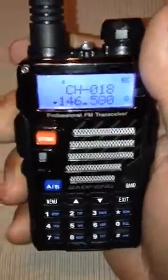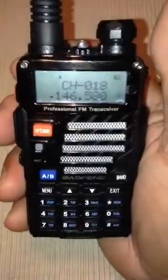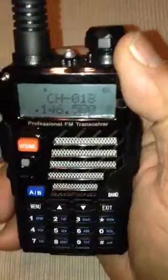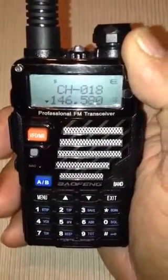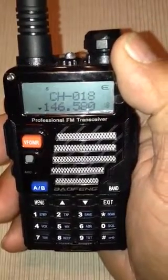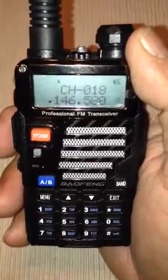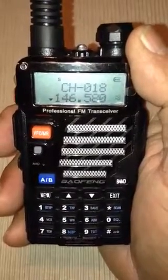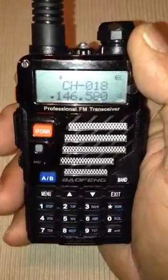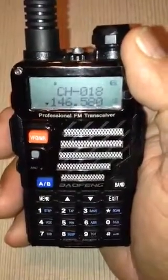There we go. Have fun with these new radios. 1 watt is low, 4 watts is high. It's dual band — 70 centimeter and 2 meter. And right there we just got done showing you how to put a simplex frequency in. Be sure to subscribe to this channel and have fun with these radios — I know I am. Have a good one. Dash Rip Rock, so long for now. Next time around I'll show you how to put in a repeater frequency, and then we're going to go on to 70 centimeters, so stick around and stay tuned.